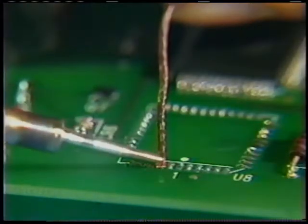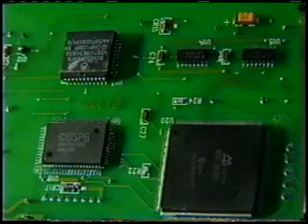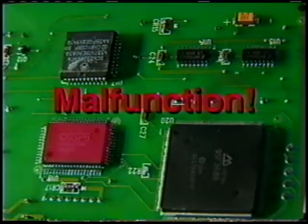After you decide you have an issue with a circuit board, it typically resulted from a bad chip. You must find it and remove it. You must also remove the solder wick residue from the pads as well. Solder becomes embrittled if you reheat it too many times, which can lead to a failed solder connection and a major breakdown in your system if you do not remove the solder.